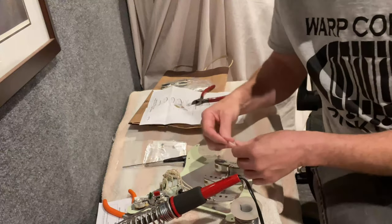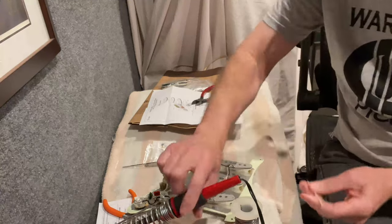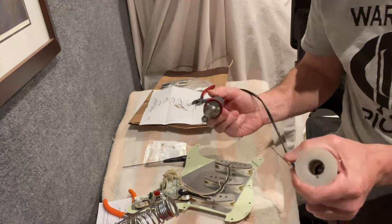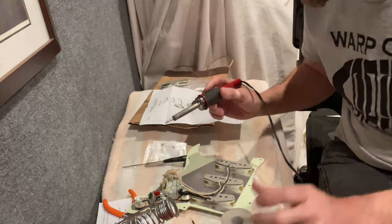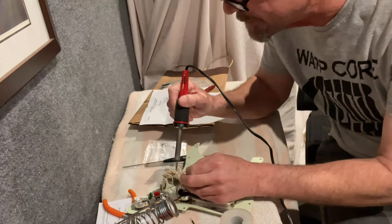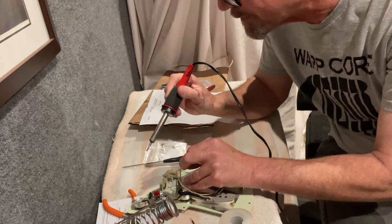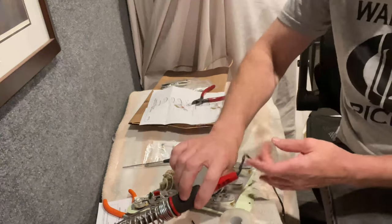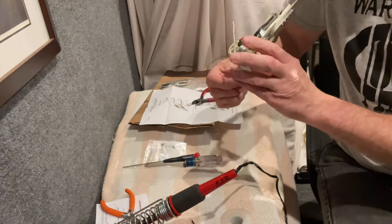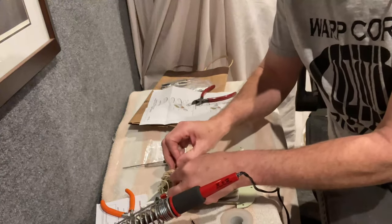The hot comes off the center. I'm going to carefully move that out of my way, clean the soldering iron tip, put a little solder on there, and then carefully add this in on that lug — just slides right on. Check our work, make sure it's in there, make sure we're not messing anything up. Looks good — I don't even need to do any trimming. And this will feed through here.